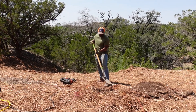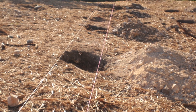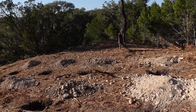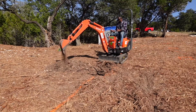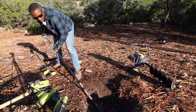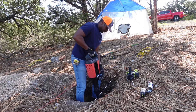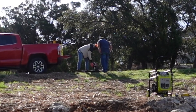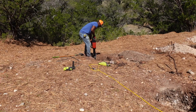Leading up until this point of the journey, I've been digging the footings for the foundation. The foundation has 20 individual spread footings, and each of the footings go down 24 inches deep and 24 inches wide as well. I've tried everything — a mini excavator, an auger drill, a rotary hammer drill, and even an anchor bar. And ironically, the best tool for breaking this tough and rocky clay loam and limestone soil is this jackhammer that my neighbor Dennis is letting me borrow. Its only downside is how long it actually takes to dig down to the footing depth of 24 inches.